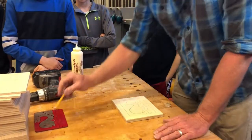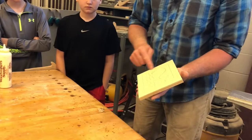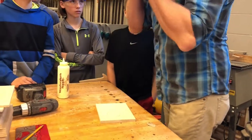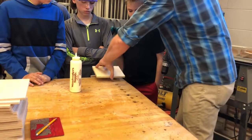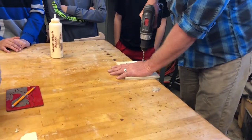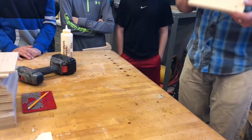Let's see how I did — looks pretty good. That's not too hard. Here's the pencil. We're going to cut this on the scroll saw. Now, this is going to be the frame — we do not want to cut the frame, so we want to use an internal cut. I'm going to use this drill. There's a drill bit right here, and you can drill down into one of these holes. You can put it in a vise and hold it in place. You can drill in any of the four corners — I usually use this corner down here. There's our hole that we're going to use to insert the scroll saw blade.